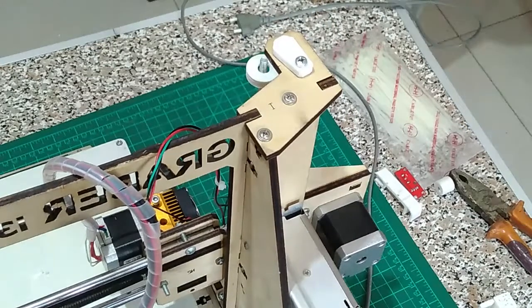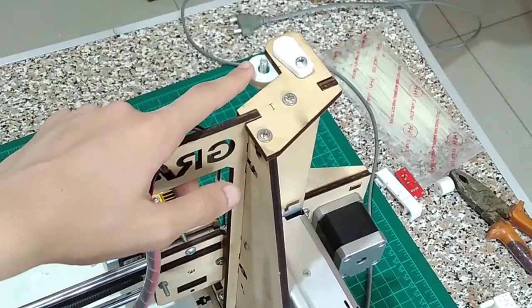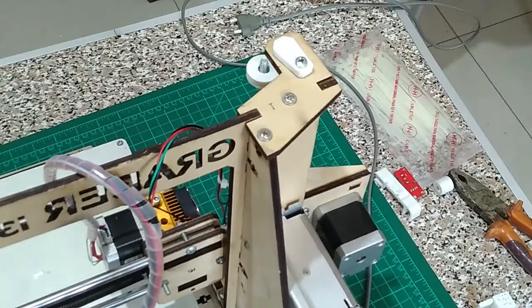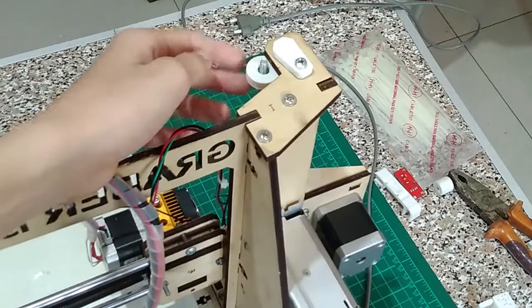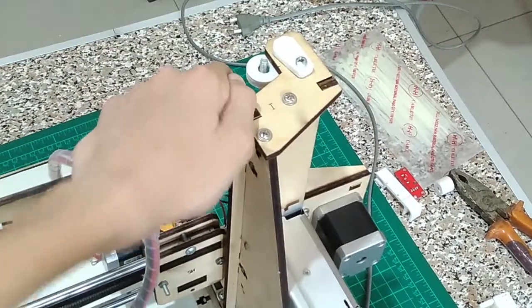Guys, as you can see, and it's on the other side as well. And quickly let's run through the settings. So I printed it at 200C on the nozzle, 70 millimeters a second at 0.15 layer height and 25% infill. So this is the basic settings for most of the parts that I used. I just tweaked the speed and the temperature. I did not change anything else, with 2 perimeters and 2 top layers and 2 bottom layers on all of these parts.